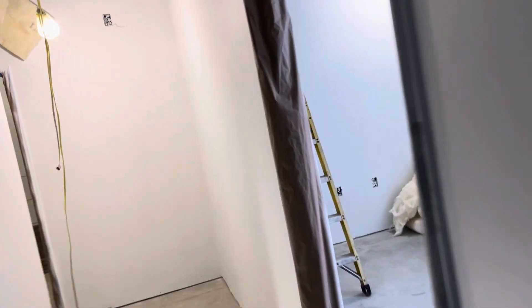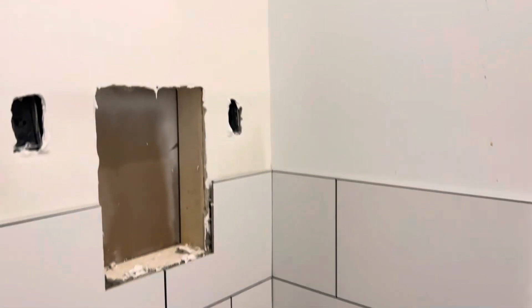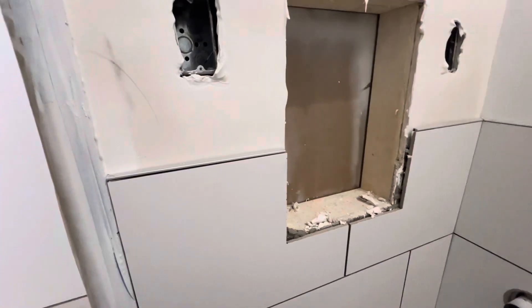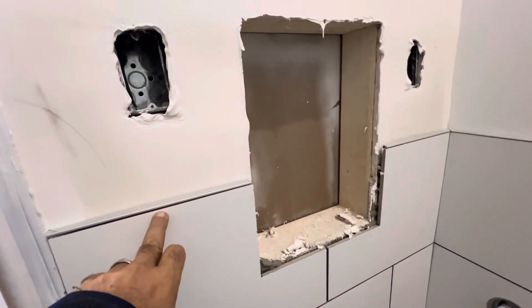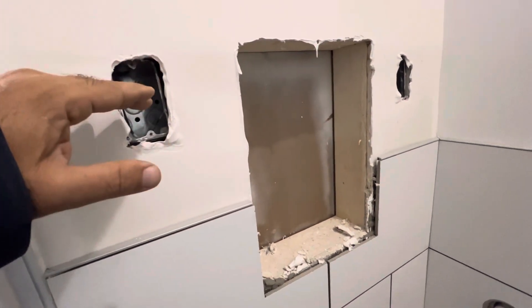We will do corner from outside and inside. Here in this single bathroom you can see the ceiling tiles. These two electrical boxes are at four-foot height at the center. We raised them up six inches to be above the tiles. There is an option to put the tiles around them, but we prefer to raise the boxes up.